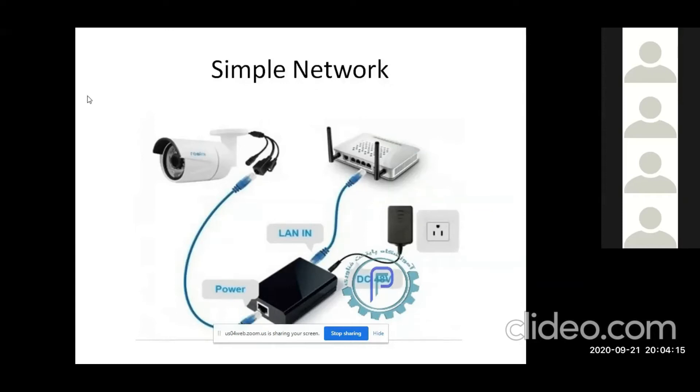When I put my camera on the top, I don't have power at the bottom — the camera is above the top. If we are using this adapter, we will get the adapter. I will show you a new Cat6 cable — the pair of cables: blue and white of blue, brown and white of brown. Blue is positive, brown is negative.